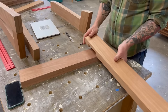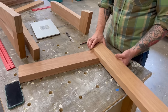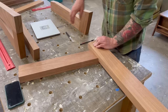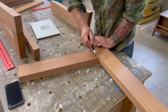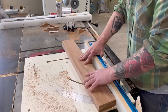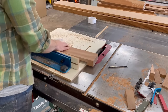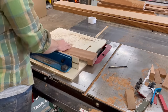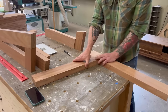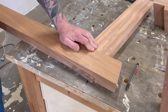Now we've got to cut the half laps on our seat back pieces. I'm sure these have some technical term that chair makers would know, but I'm going to call them seat back pieces. I lay one half lap over the top making sure there's just a little bit hanging out the bottom, then using an exacto knife I cut a nice straight line right where I need to start my half lap cut, marking it on either side as a reference. Using the same wedge technique to get my angle right, I run it back and forth, going all the way down the piece — this lap is going to hang out the bottom and that is okay. I test the fit and it fits just how I want it with just a little bit hanging out that we will clean up after gluing.